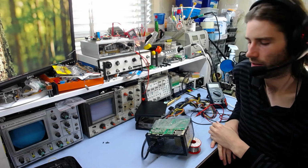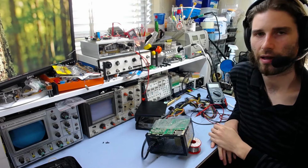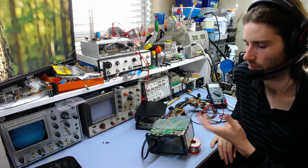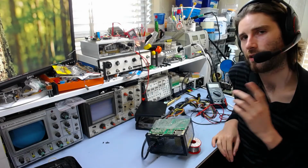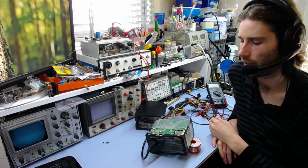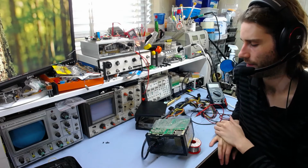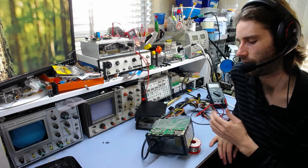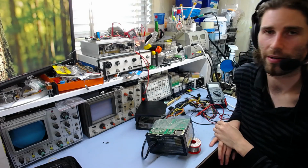Yeah, if I get the go-ahead to repair it, then I'll repair it, and well, I can show that happening. And I mean, it should really just be a case of replacing that controller and replacing the resistor. So if that's all there is to this, then I'll see you next time. But if not, then I'll come back and we'll have a look at repairing this thing. But yeah, as it stands, it doesn't work, and this is obviously why: the chip has probably gone shorted and the resistor is blown out.